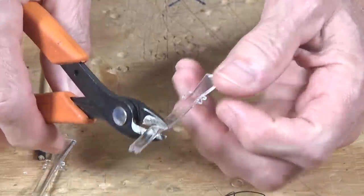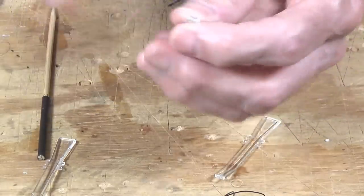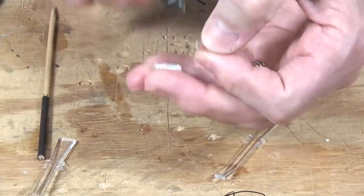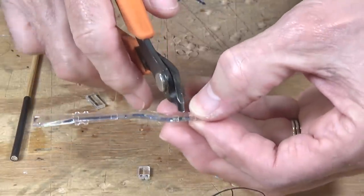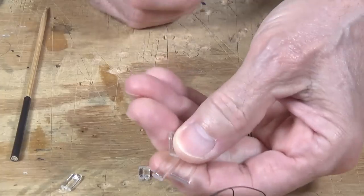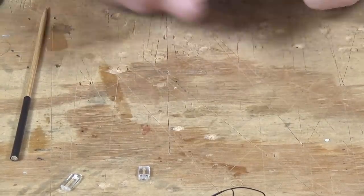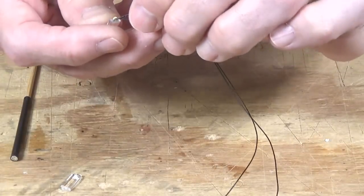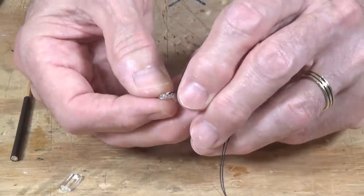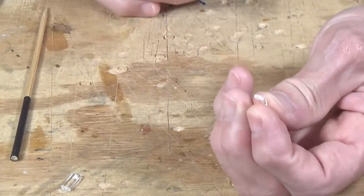So now I've got these two nice clear plastic light tubes. What I'm going to do is shorten these significantly so that I can attach the LED to these. It's really pretty crude — you can just take it and cut it like that, and it'll give you a nice square edge here to work with. I'm going to cut it even further because I want it further back up out of the way. The rest of this goes in the scrap box — don't ever throw anything away.